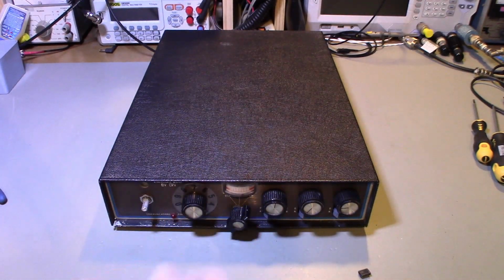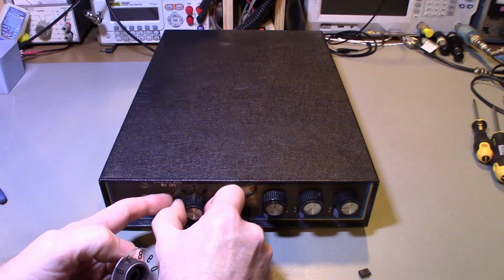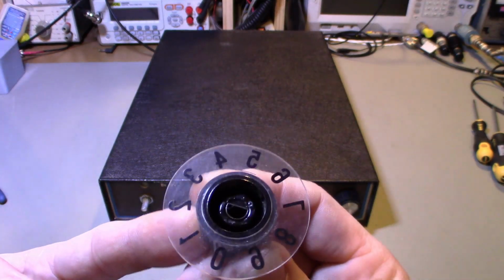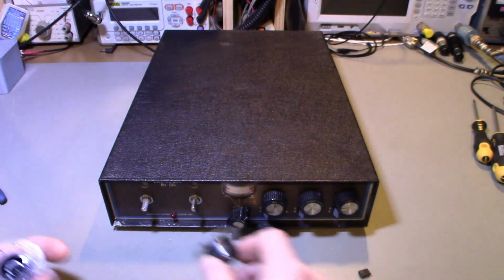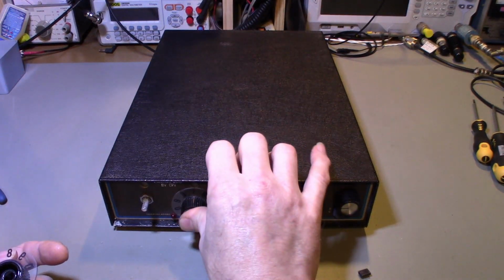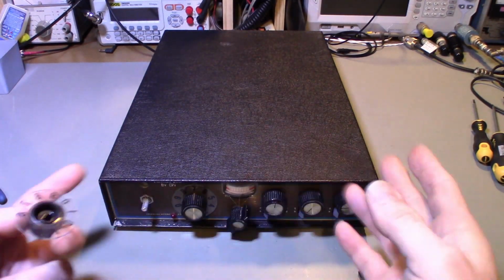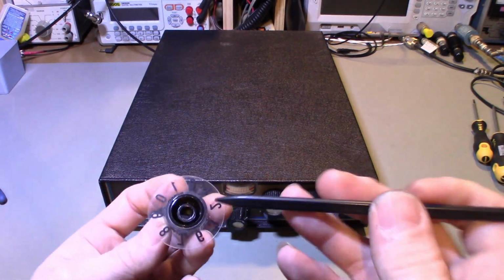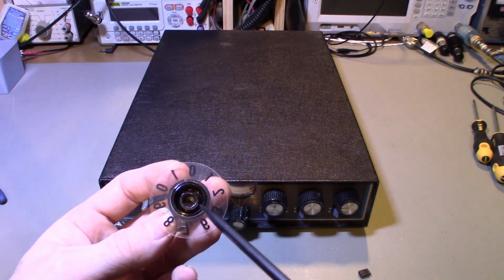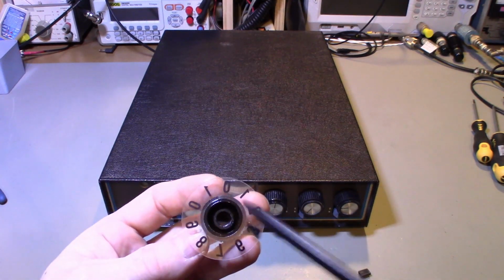And I've already repaired this one. See, that one's nice and tight. Pull back off here. You can see this one has the knob spring in it and it's been glued. Now what I'm using is not normal glue like you would think about it, glue that has sticky stuff that sticks to anything. Really what we're doing is welding this, but we're not using heat. We're using basically a solvent to glue this together, or weld the plastic back together.